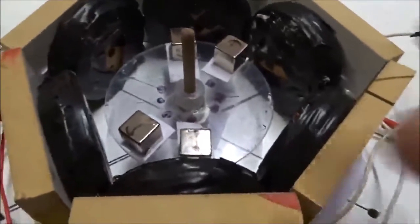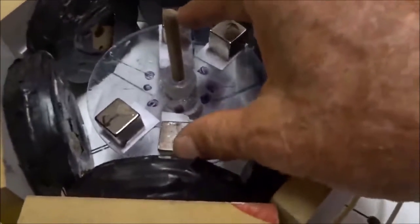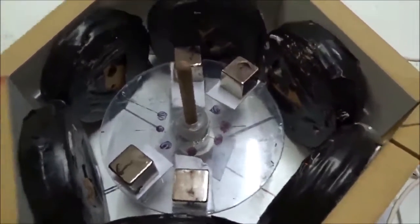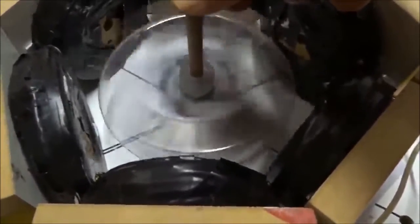Next we're going to have four magnets — two magnets arranged at U and U, and two magnets arranged 60 degrees away from U and U. Not 90 degrees away. Remember, the 90 degrees went clockwise. And now when you turn this on, they synchronize and lock very nicely anticlockwise. Look at that — beautifully balanced. So we can make it go clockwise or anticlockwise depending on the angle between the two different sets of magnets.